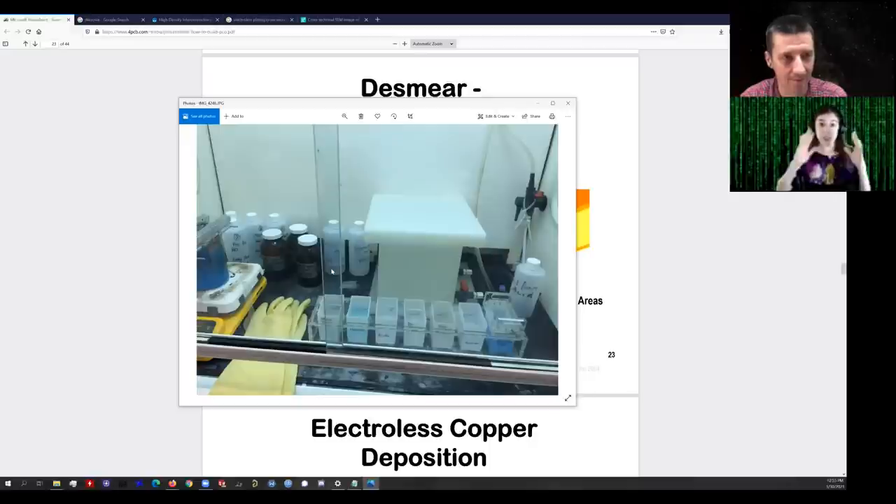Fiberglass is composed of the glass component and the epoxy. The epoxy is an organic polymer, and there are chemical functionalities that in the presence of certain chemicals can be rendered charged. In the first bath, we have a micro-etch — usually a mild oxidizer like sodium persulfate, in a dilute solution so it won't etch the copper, but it will chemically modify the surface inside the holes to generate a very mild charge, which will then electrostatically attract tin ions in the next step.